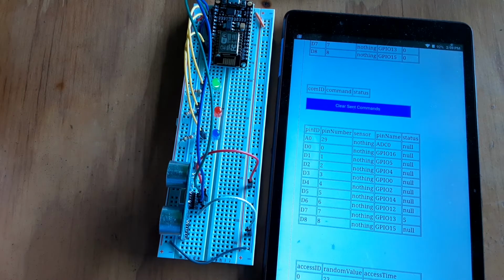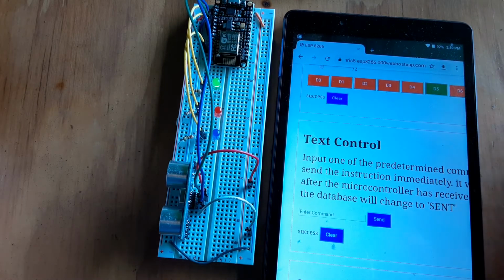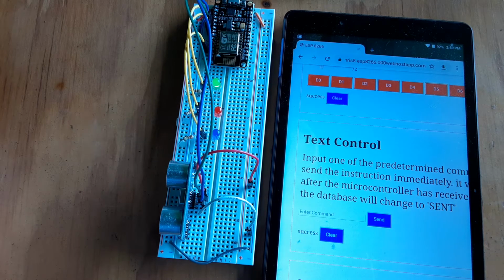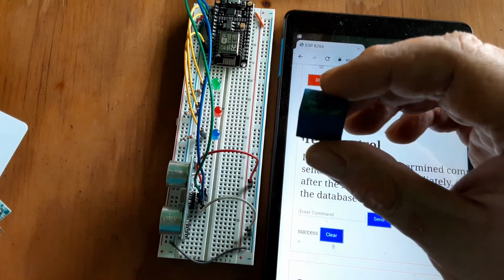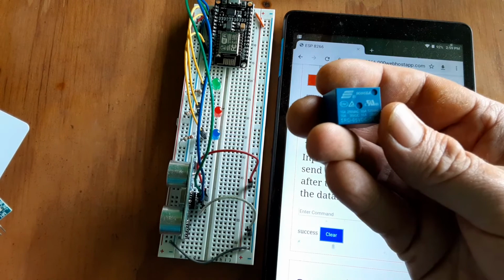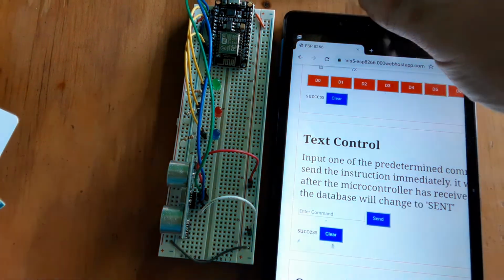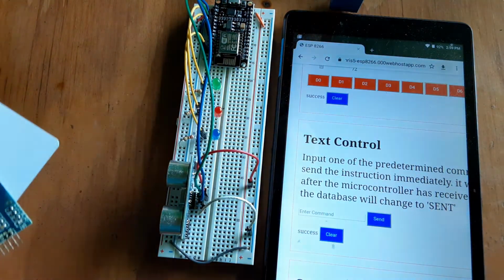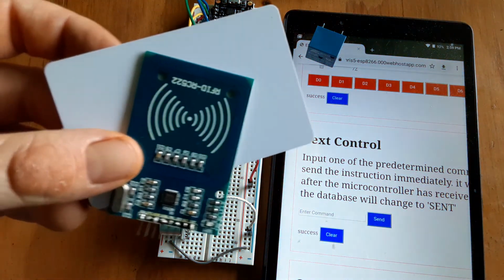So just a quick example. Yes, I know LEDs and ping sensors probably aren't what you think of with home automation and IoT projects, but again, it wouldn't be any different to triggering an LED. It's basically the same thing to trigger a relay that can handle the voltage levels to turn on and off anything in your house. You get a lot more power that way. So a relay or something like an RFID sensor.